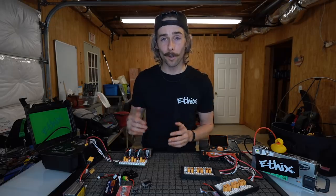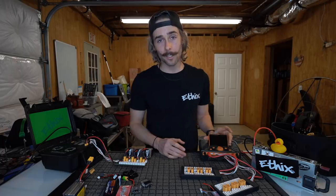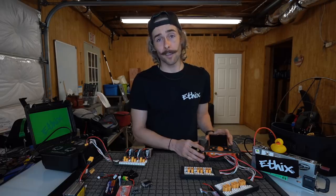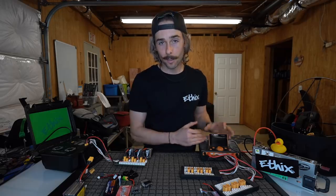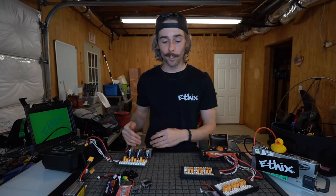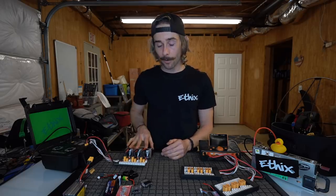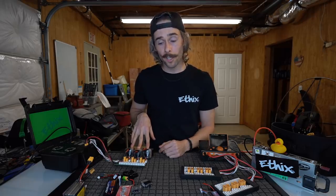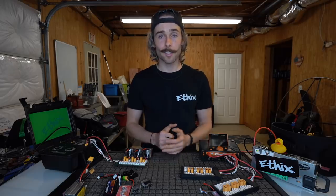very largely varied voltage. And I would say 99.9% of the problems that you ever see with lithium polymer batteries catching on fire is usually a charging related issue or someone poking a nail into them, okay? So it's usually a human error with something to do with the charger. It might be a low quality charger, or it might just be something where the human plugged it into the charger incorrectly and that led to a problem. Okay, so if you accurately assess your batteries, you understand, hey, I've got all these batteries within a certain voltage, 0.3 volts of each other, and I've plugged them all in parallel, and I know that my charger can handle it, well, that is going to be perfectly safe as far as parallel charging is concerned.